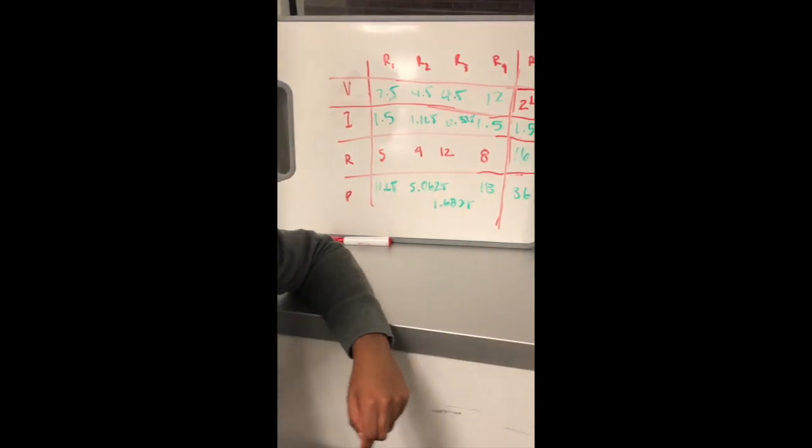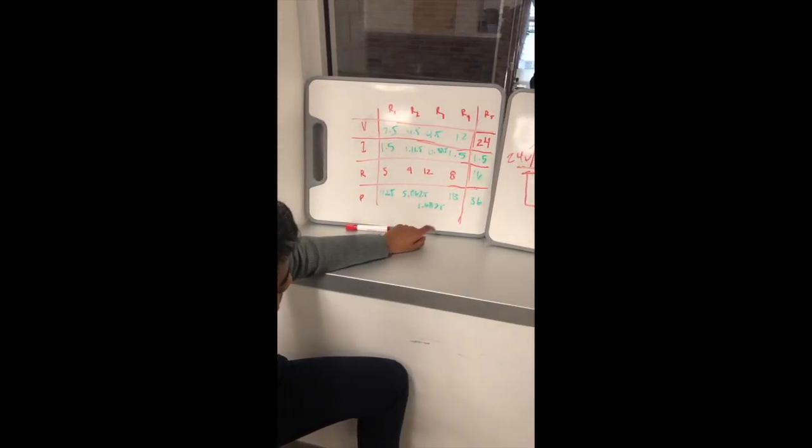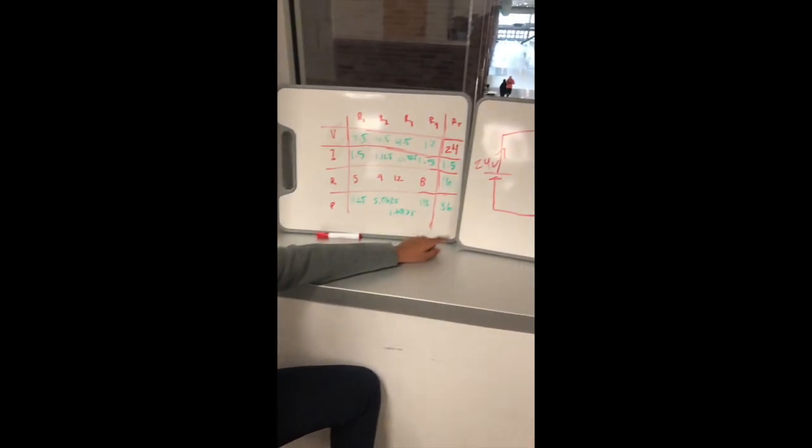Now, you always know that you did a circuit right when all of your powers, when you add them all up, they equal 36. In this case, they do. So congratulations, you've just solved your first ever combined circuit.